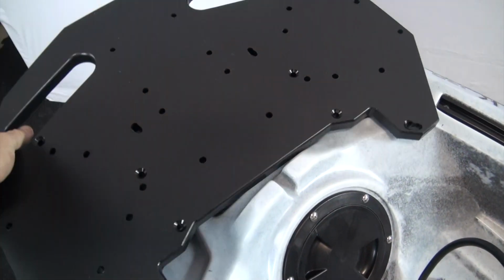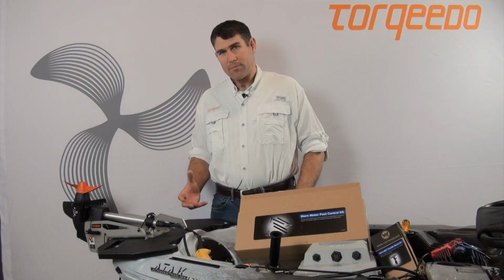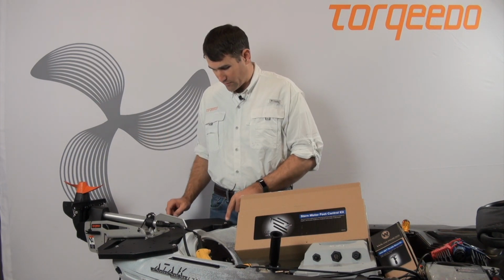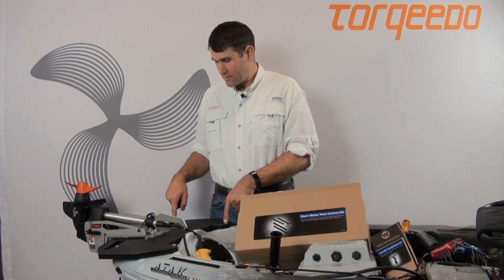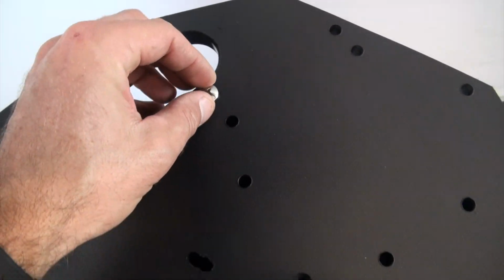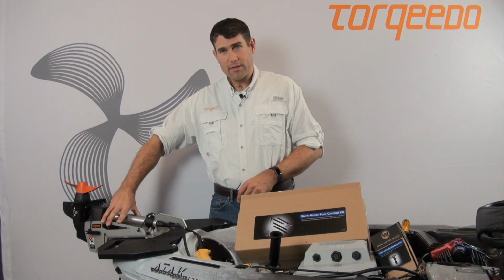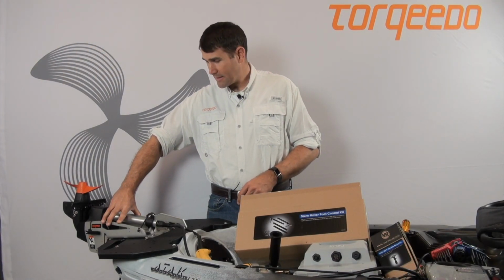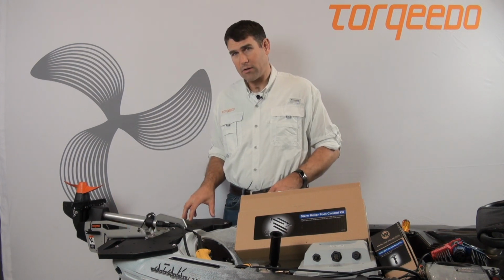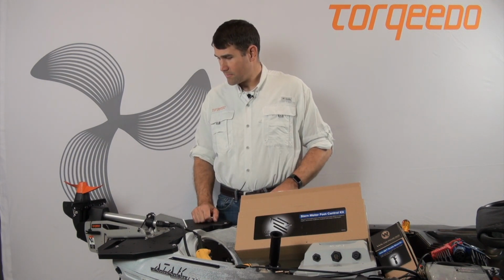It is a thicker stern mount. The reason for that, we wanted something to be as strong as possible. The attachment points on this, we actually have 6 of them that basically bolt into the existing threaded inserts molded into the kayak. So 6 attachment points here. The 4-bolt pattern for this Torqeedo Ultralight 403AC, and then there's also, if you'd like to put a Power-Pole here and here, you can do that. So you can do Torqeedo, Power-Pole. So that's a nice option.